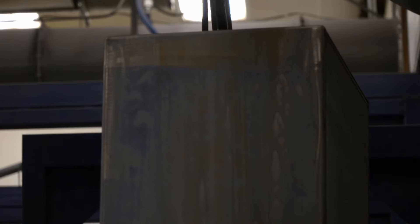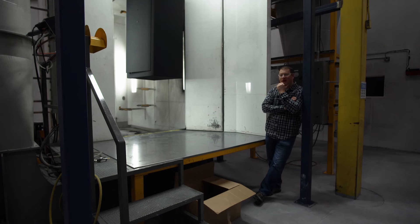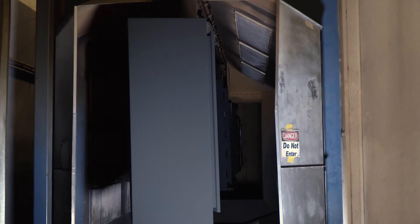In the paint room, an endless march of safes moves down a slowly creeping conveyor. It is such a cool process to watch. Those little paint particles are actually electrically charged and the safe is grounded, so when the nozzles spray, all those particles absolutely stick like a magnet. The safes then run through a two-stage oven — the infrared sets off the gelling process and then the convection oven cures it over a 30 to 45 minute cycle.